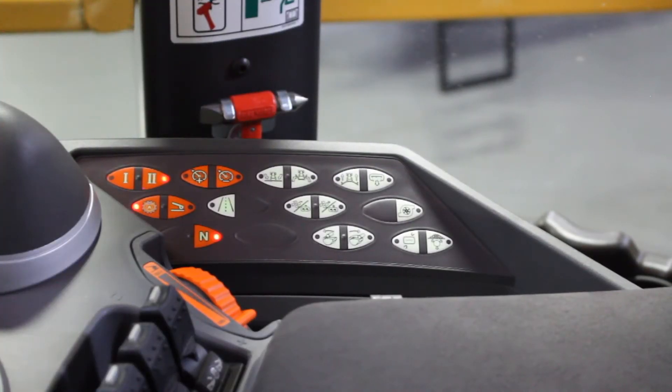The white switch on the side armrest for an Air Max or an air spreader: the top one, which is the auto fold for a liquid system, is not used. One below that will be for our fan increase and decrease. Below that we have our electric roll tarp — one side rolls the tarp closed, the other side will roll it open. The back row of switches are not used on an air dry system.